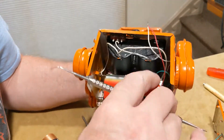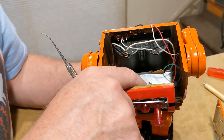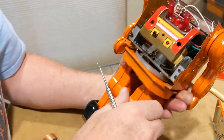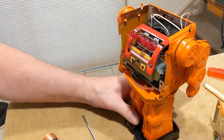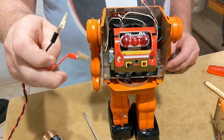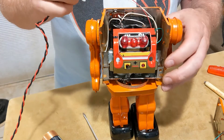The problematic parts are these pinion gears. I was going to put glue on them to lock them in place because they're probably going to break once it starts running — that gear is going to break. But I'm also going to get voltage on this motor. I have a power supply dialed into three volts. I'm going to bypass the switch and go directly to the motor to see if this is going to work.